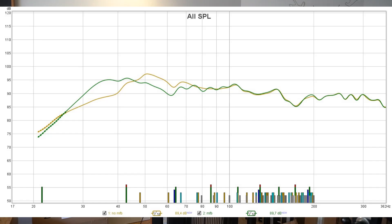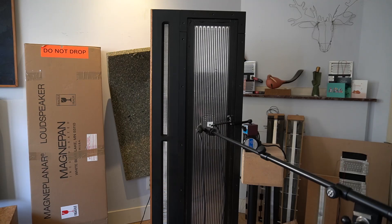I think you need a smaller panel, higher excursion, higher membrane tension if possible, and then you can use the circuit to play lower than the panel normally should be capable of. Then again, if you ask whether the distortion is better — no, it probably won't be, because you're just pumping in energy. Making it bigger solves both: lower distortion and it can reach lower. But things get huge. The benefit of using the circuit is you can make small things play low — and quite nicely so, mostly in a dynamic driver, as I showed yesterday, in a small closed box.